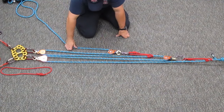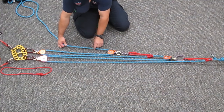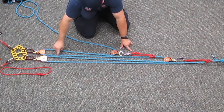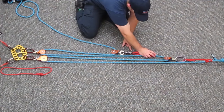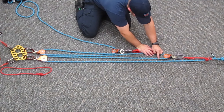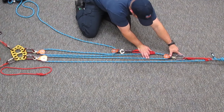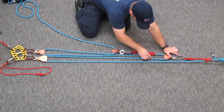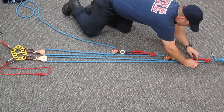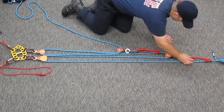You can tell it's a 9 to 1 by using the T method. Starting with 1 unit of tension on this strand creates 2 units of tension, and follows all the way through to create 3 units of tension on this strand. Now 3 units of tension come in and out of this pulley, creating 6 units of tension at the end of this pulley. That 3 continues on through this strand, and 3 units of tension combine onto the 6 units of tension to create 9 units of tension at the load.